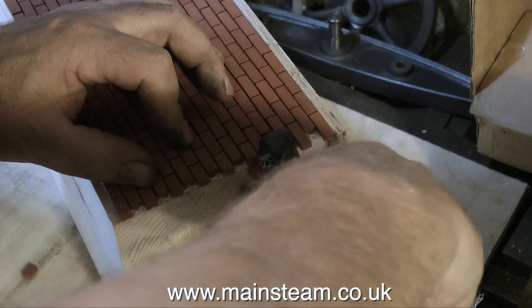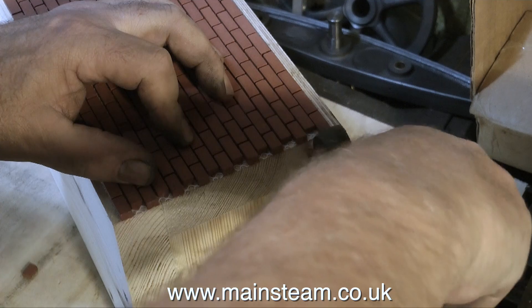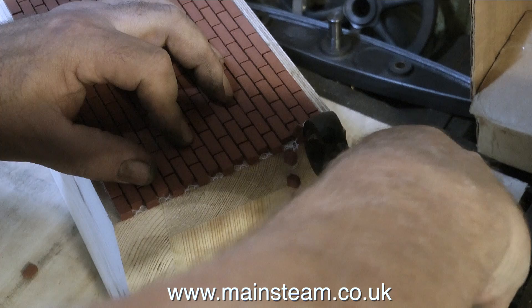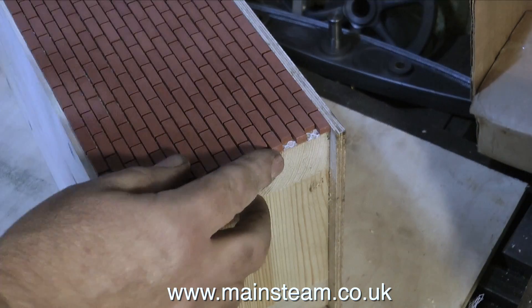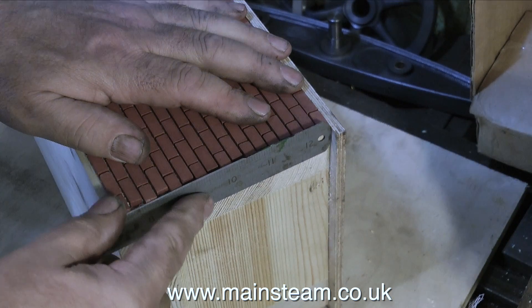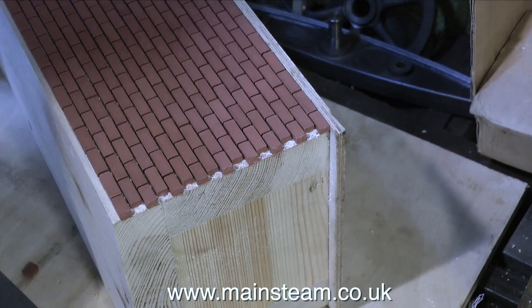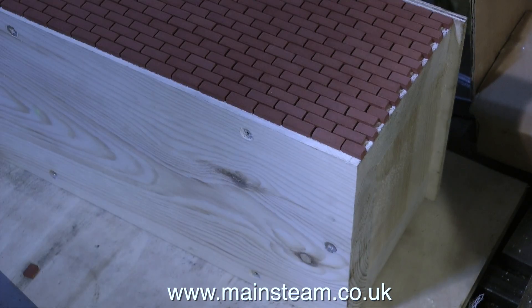In the last episode I was looking at the best way to get the corners to look right. Because these bricks are thin, going round corners gives it away. One solution was to pre-fit corners made of mahogany or brass and run the brick up to them, but in the end I've decided to run the bricks all the way to the edge and then use a piece of 1/16" brass angle to cover the join at the corners. It'll look quite good and will protect the brick. That's all for now, thanks for watching, I hope you found it useful.